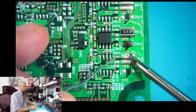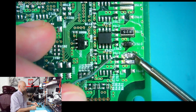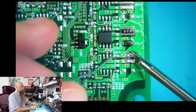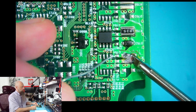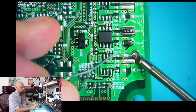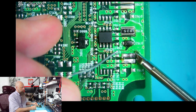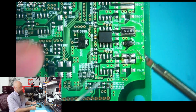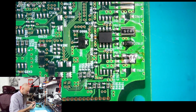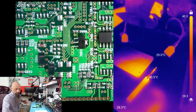You can see how little energy it has, thermal energy, or thermal mass. Okay, yeah, it's not hot enough. And the solder is flowing, or it seems, but I can feel it under with my hand. I can feel that it's not hot enough. Now it's getting there. Now it's getting there. So it needs a little while to heat up. Now let's see what the actual temperature of the tip will be.